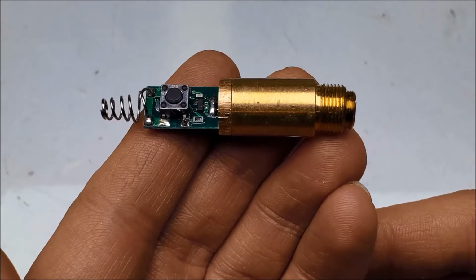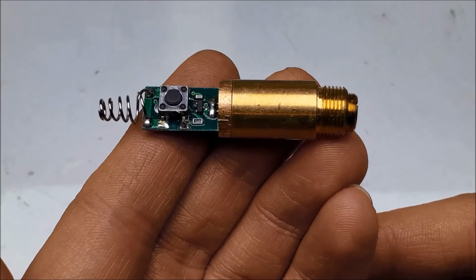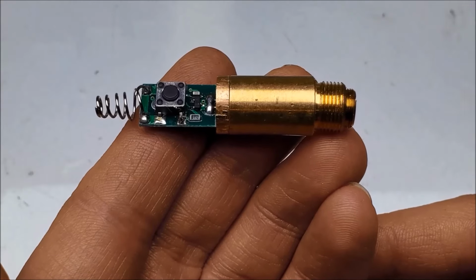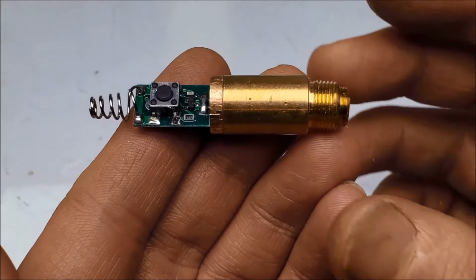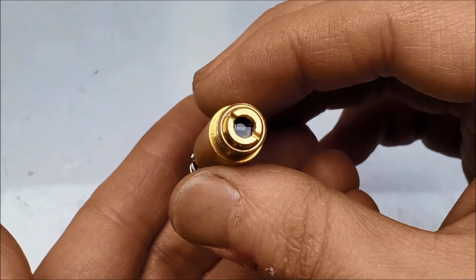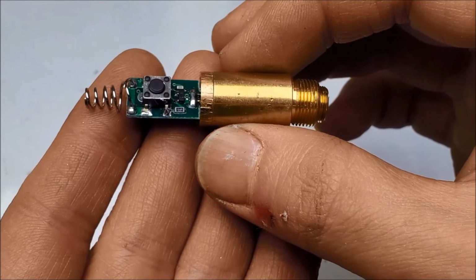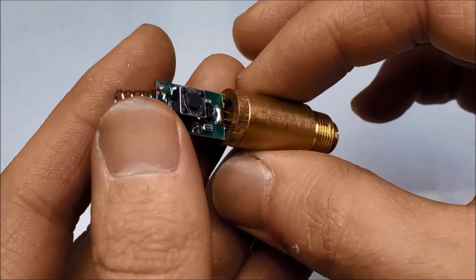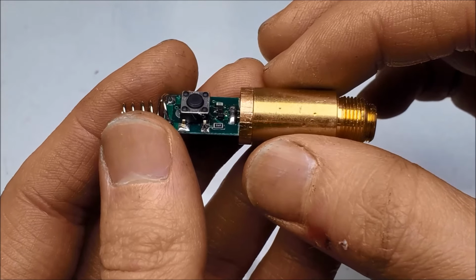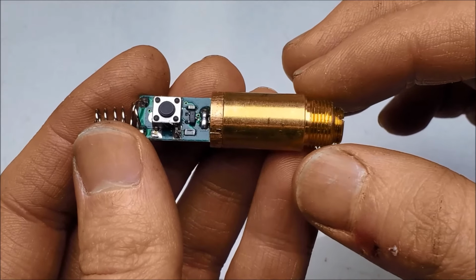So here's the fully modified module that was from the late 1990s and used to do 532 nanometers of green laser light. Now it's converted over to do 593 nanometers, which is a goldenrod yellow color. I took the brass tube assembly and collimating lens off the yellow module that was bad as well. Put that on. Turned out real nice. So at this point, it's good to go into a laser pointer. So let's break out the solvents, supplies, and start a montage. I'm building a golden laser pointer.